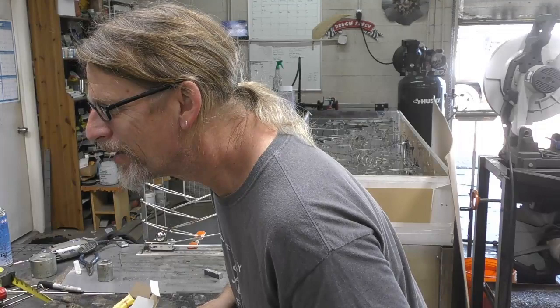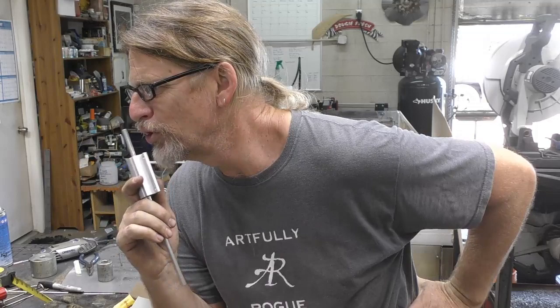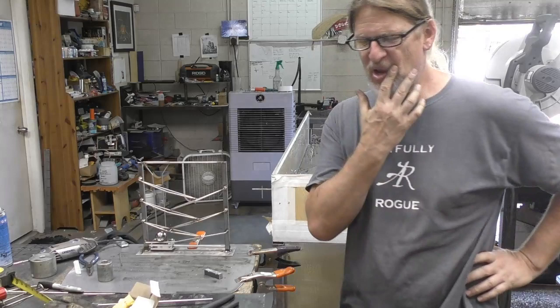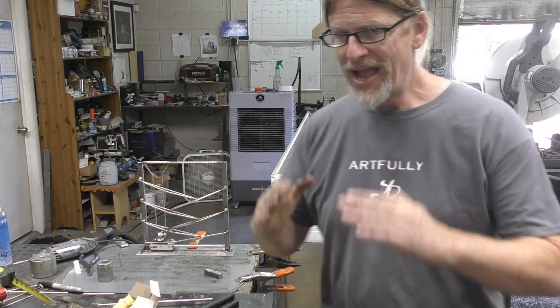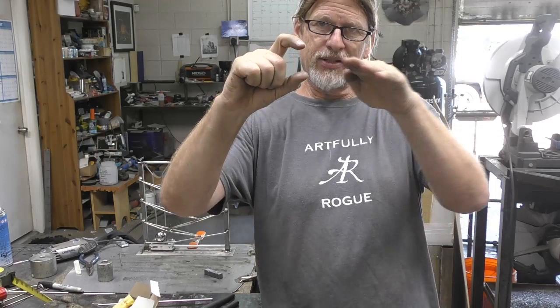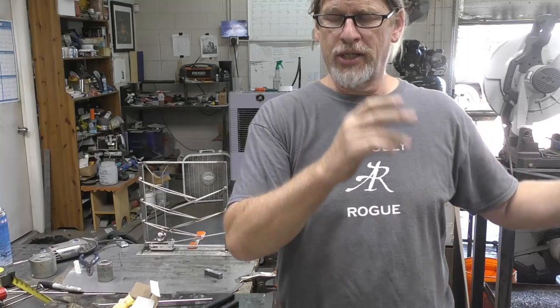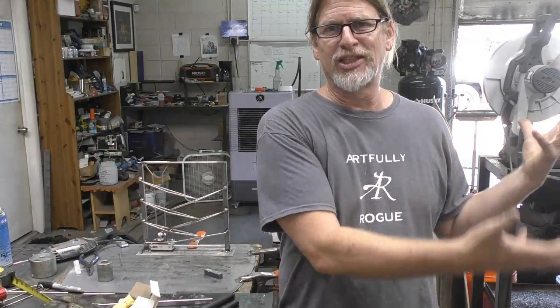Oh yeah, Jason, you're right. Need to make a bottom slope to one direction and have a collection for loose balls to restart the lifter. Yes, I might have mentioned this before. The current base that is in here right now actually does have a bit of a slant, a bit of an incline. So there is probably about an inch of height all the way down to zero at the end. So you got 4 feet going one inch to zero, and then another 4 feet of one inch to zero. With that same intention, ball falls off, it rolls back, it gets back into line, and it gets back in the system.